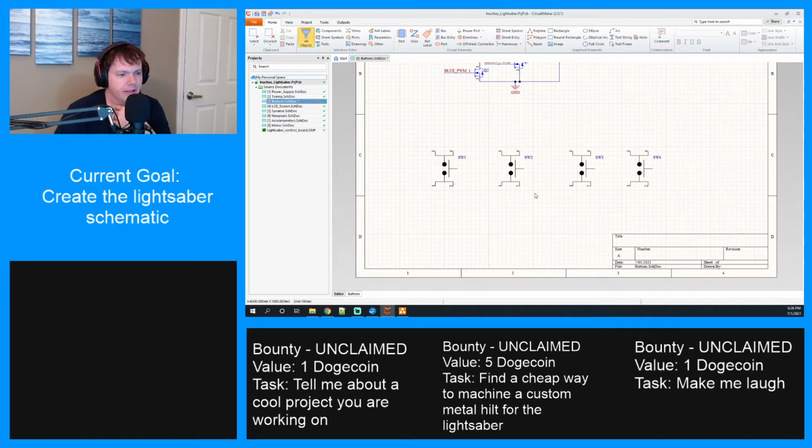I guess now we gotta figure out exactly how we're gonna do it. I think I was just gonna connect them to ground and then probably run them through resistors to the actual board just for some sort of protection. We could kind of debounce too if we want to do that, but I think we could do that internally on the board or in the software easy enough. Though it wouldn't hurt to have it.